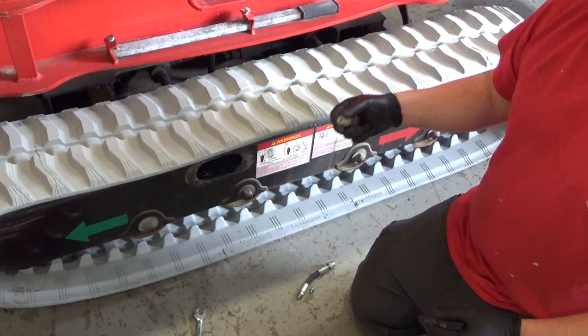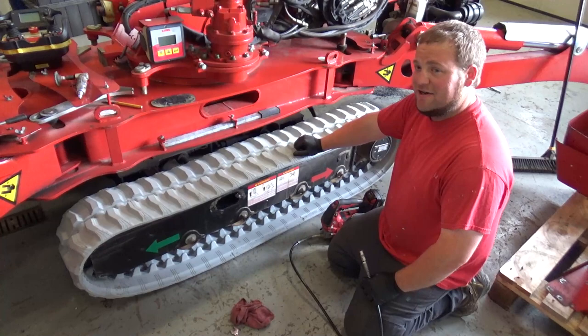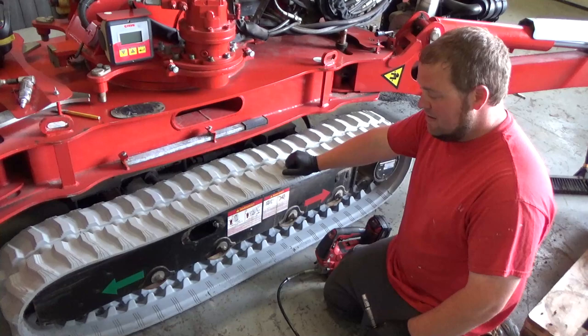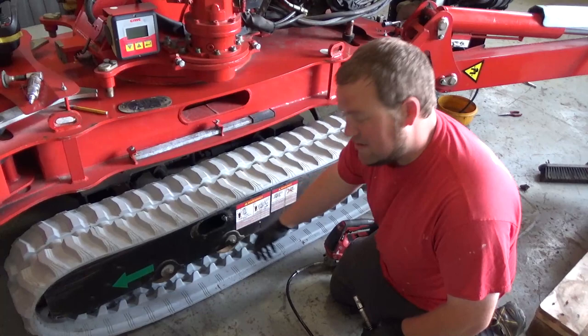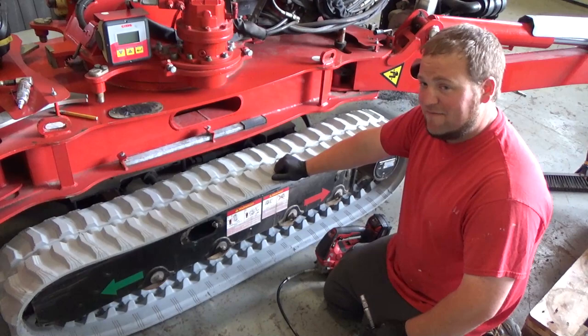As you can see, we have our new tracks on now. All of our grease fittings are back together and we're ready to start greasing up. To fill the tracks, we highly suggest you use a better quality grease than you normally do. We prefer to use the Lucas Red'n Tacky here in the shop — it seems to hold up the best and compress the least. You want to pull them tight so that all the track is tight up against the running gear. After you're done, don't forget to put your inspection plate back on and push the hose back through the hole so it's not stuck in a bend. Follow us on Facebook at Aerial Lift Repairs or at our website AerialLiftRepairs.com for more updates and tech tips. We'll see you next time.